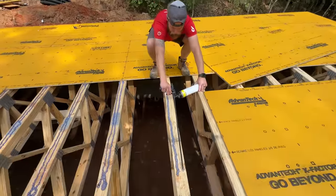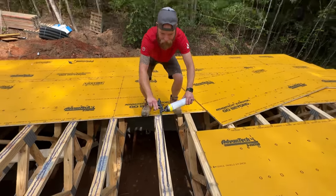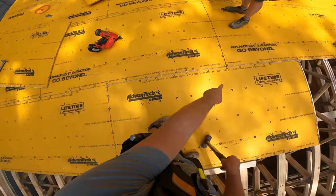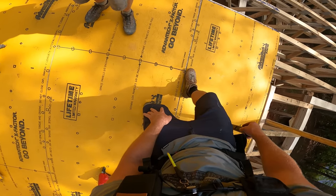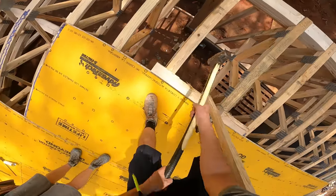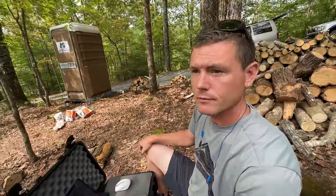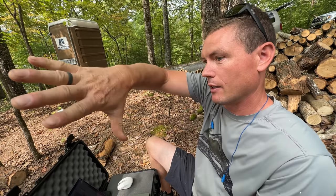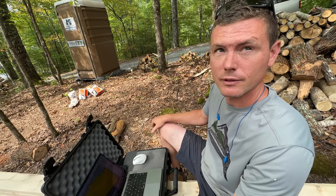I feel like they did some measurements of the squat capability of a carpenter — they made the length of that gun just the right length to reach out more feet. We're putting these sheets in and if I take more than a couple swings and the joint isn't getting tight — like it's not going in the tongue and groove — it's usually a high truss making the tongue and groove not align. I'm going to have Arlo stand right there as my dead weight to hopefully make it slide right in. Somebody said you could ream one corner in and nail it, then sling it, pivoting off that one, and slam it in. I'd go with the sledge though.